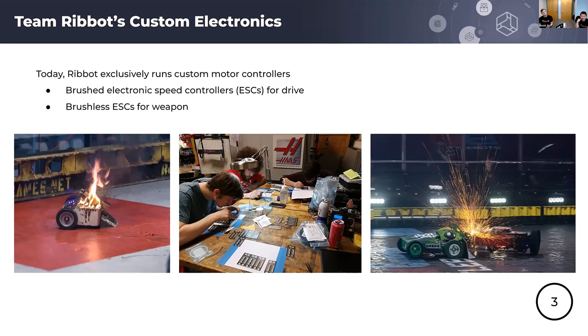We applied and were accepted to the full TV show of BattleBots in 2019 and have been competing since. One thing that makes Team Ribbot unique is that we run exclusively custom motor controllers. A lot of teams use off-the-shelf components not designed for combat, resulting in failures. That photo from RoboGames 2018 was actually right before a match — Nick went to turn on the robot and it spontaneously combusted. Our theory is something went wrong initializing one of our off-the-shelf controllers. Since then, we decided off-the-shelf controllers were not worth it.